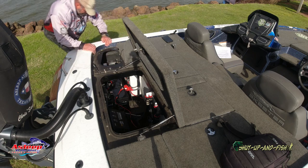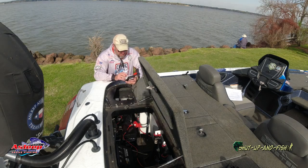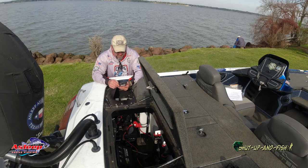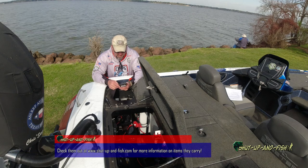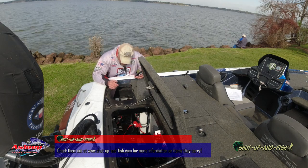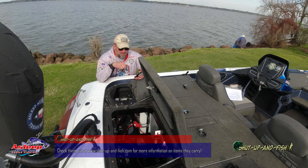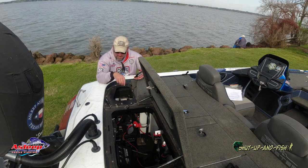All right, I'm going to try my trolling motor. All right guys, so that is the install of the lithium batteries — pretty cool. Let me go into the charger app here. Connection — it doesn't really matter which one. 13.13 volts, zero amperage being used right now, so it's on standby. Still at 20 degrees Celsius. Pretty cool — it's still working. Still at 53% charge. So what I'm going to do is move over there and hook up to power and charge this thing for a bit while I do some other stuff.